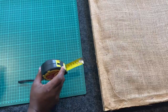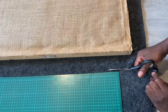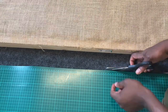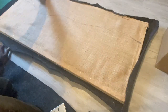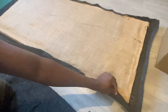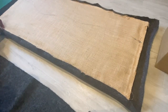The next step is to cut three inches of acoustic fabric on all corners of the acoustic panel with a trim scissors. Trim the fabric bespoke to whatever size of acoustic panel you've got, making sure it's even on the sides and latches properly onto the pine wood. Once you've replicated the process on all four sides, the next step is to press the acoustic fabric onto the sides of the pine wood and then staple it all through. It's best to start stapling from the center, then spread out the staples so you can easily stretch the acoustic fabric where needed.